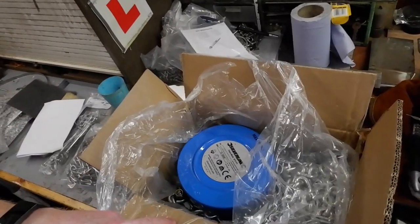Right guys, we've had a few questions on how we're going to get the Lindsay B out the shed. Well, basically we're going to do old school. It's a traditional boat, I'm a traditional fisherman, we're going to do it the traditional way. And that is basically by scaffolding pole. What we're going to do is put the poles down on the floor, drop the boat onto the poles, and then we're going to drag her by my brand new 3-ton chain block sideways. And then we'll drag her forward out the shed. Failing that, I'm going to kidnap 15 bodies and basically manually drag her out. That's the way it's going to happen. So there's no ifs or buts yet, or whens definitely.